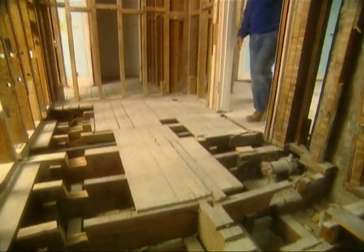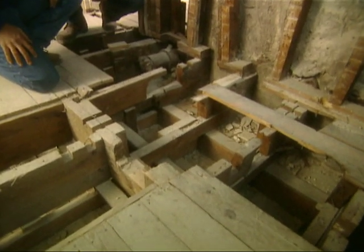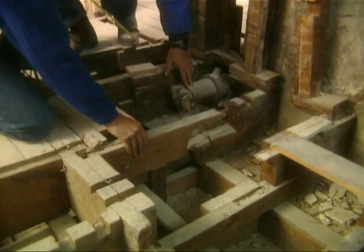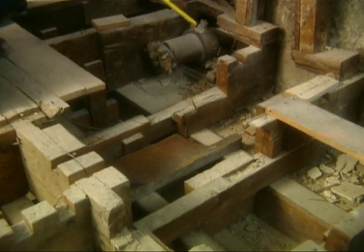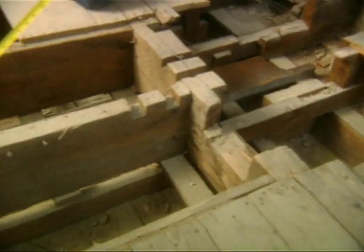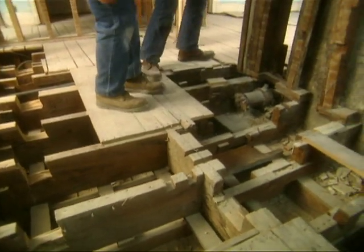Let's take a stop on the second floor, Frank — I'm going to put you on the spot. Why do plumbers do this? Look at the condition of the framing here. Well, you can blame integrity — they removed the integrity from the building with lack of integrity of their own. Here's the four-inch cast iron soil pipe that comes up from the basement underground, and you can see where they cut this joist out right here — similar things all the way around. This was probably the original stack from the turn of the century, and then it went to PVC pipe, probably put in in the early 70s. Every time somebody came in here with the advent of good reciprocating saws, what a mess. Didn't leave you much.